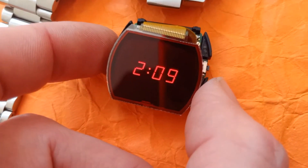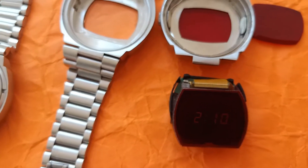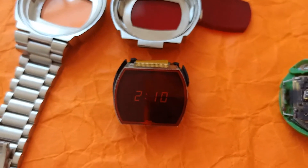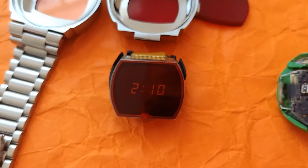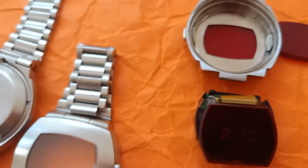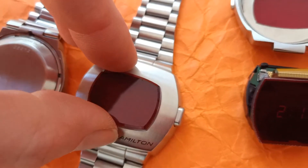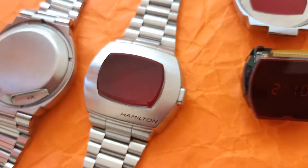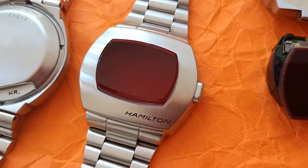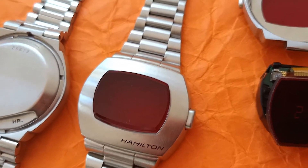The reissue is slightly bigger than the original — a little higher and taller overall. I'm quite impressed with the reissue, though compared to the Bulova Computron, which is much cheaper, the LEDs on the Pulsar are sleeker and more original-looking. What I would do is get rid of the LCD on top and replace the transparent glass crystal with the original red lens. The original red crystal is just 0.2 to 0.4mm smaller than the gap of the transparent crystal, so you can easily swap it in.